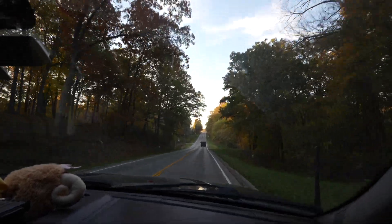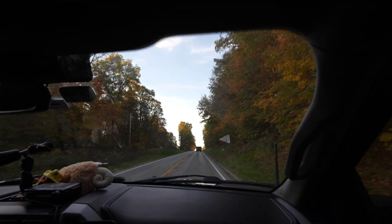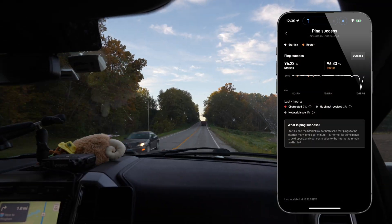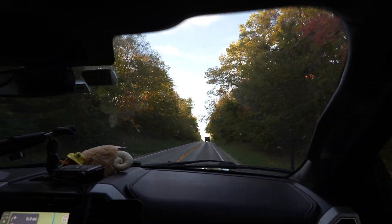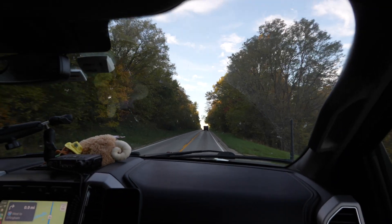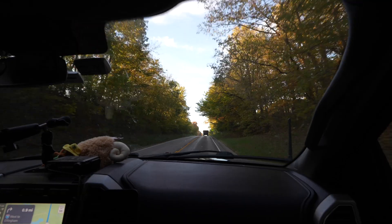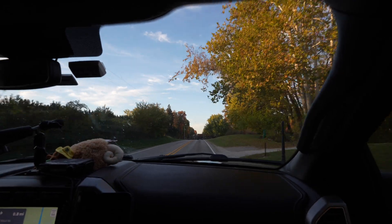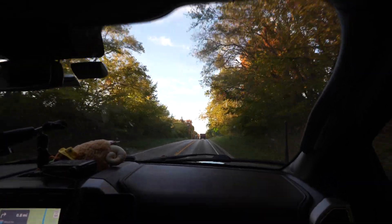Single-lane roads were a bit of a different story. With things such as trees and rocks closer to the road, it was more likely to interfere with the Starlink Mini, causing a partial obstruction that could result in anything from a little blip to a drop of a few seconds to even half a minute or a minute if there were really dense trees. This depends on where you are and what's around you. If it's just email, Slack, or a casual meeting where a drop is okay, you can probably get away with it. But for an important meeting with a customer, you might want to consider stopping and parking until your meeting is over if you're going to encounter variable conditions off a highway or interstate.